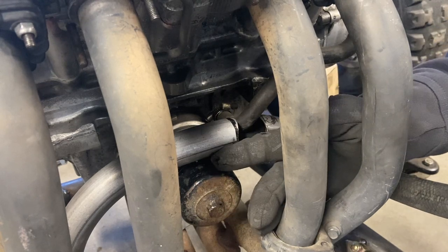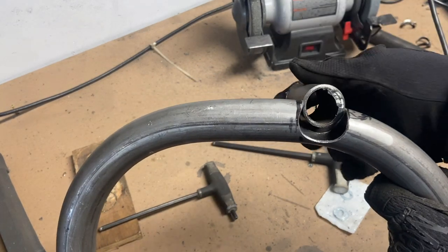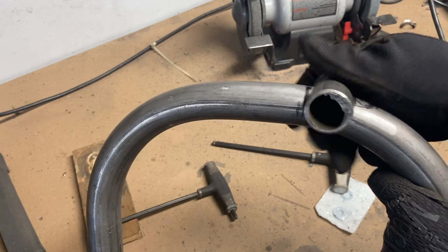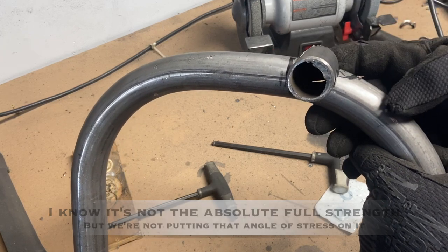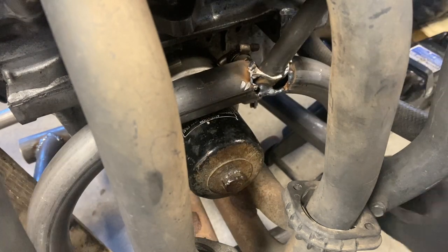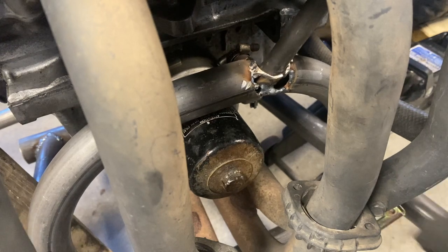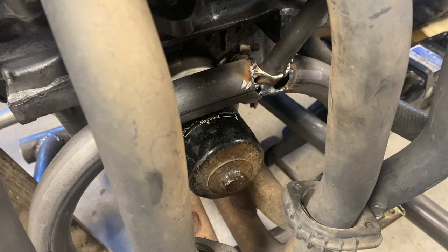So now I either have to remake the whole piece or trim it and make it work. I don't want to put this all the way down on the oil filter — it's got about a quarter inch of clearance. We made an inch-and-a-quarter notch in inch-and-a-quarter tubing, so you just slide your inch-and-a-quarter tube in, cut around it, and you have the full strength of the tube with just a recess in it. Look at that — perfect. That's the exact position and angle I want. It's not my prettiest piece of work and I'm probably going to redo the whole piece — I can't stand cobbled work.